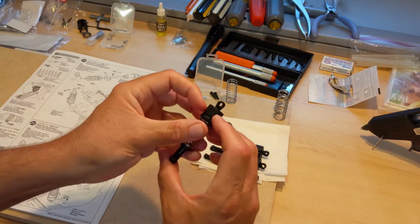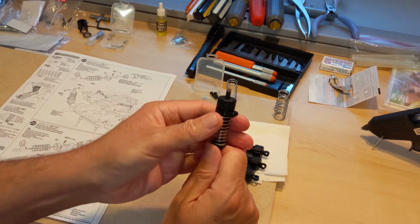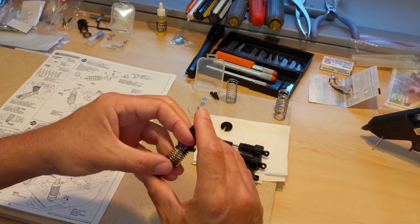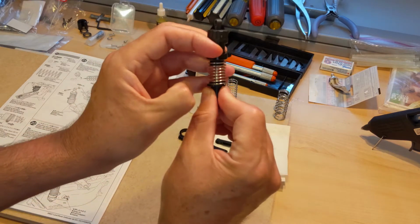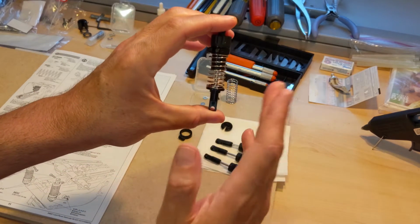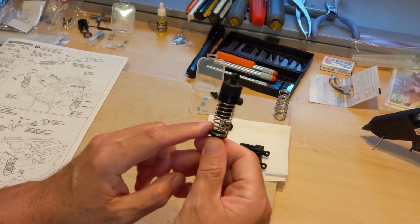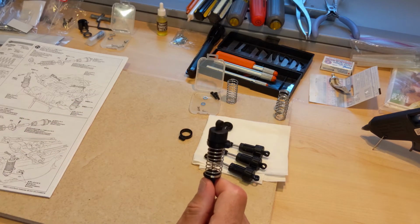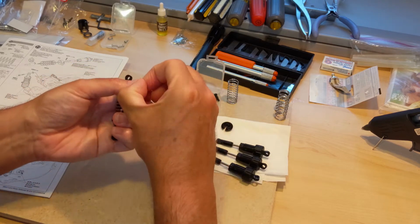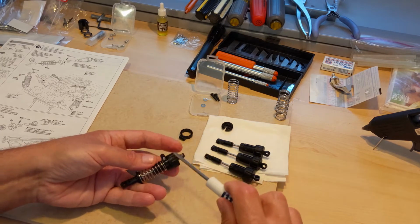So the first collar we wrapped on is a collar that allows us to pre-tension the spring. If we wanted the spring to be in more tension, we can just slip the collar down and tighten it up. For now, I'm just going to leave it at the least sprung setting, maximum spring height. I'm going to put in this screw around this collar so we don't lose it. For now, let's just drive this screw home.